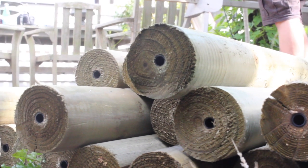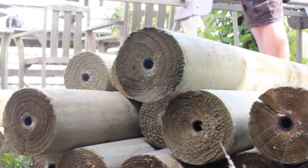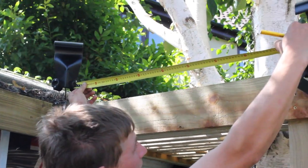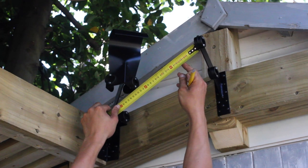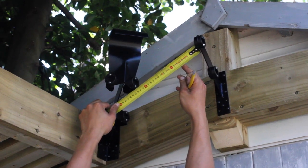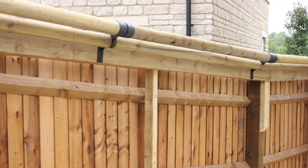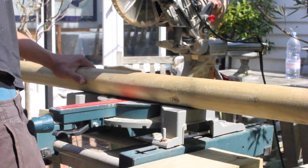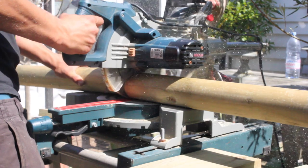For the CatSecure system to work effectively, wooden poles should be 3 inches in diameter. Measure the distance between the inner faces of the round black plastic roller supports — these inserts are already fitted in the brackets and are where the axles run. If the wood is very new and/or wet, we recommend a cut of 10mm shorter than the distance measured, to allow for any potential shrinkage of the pole.